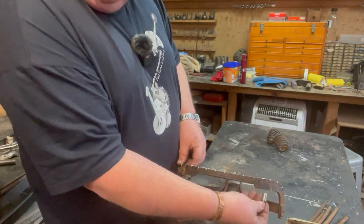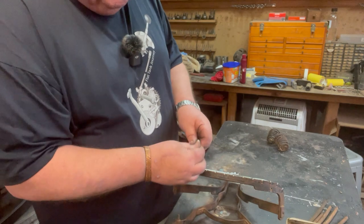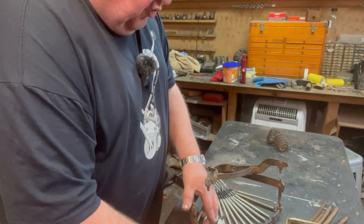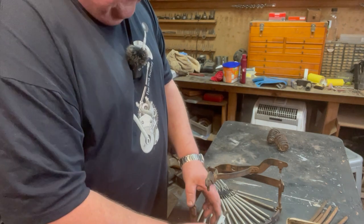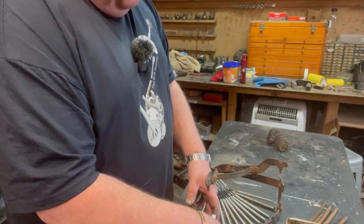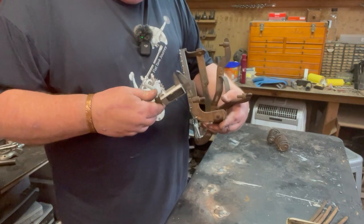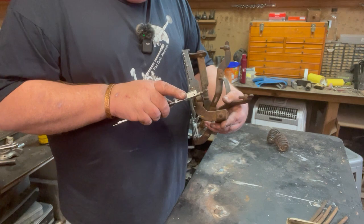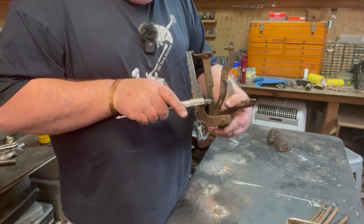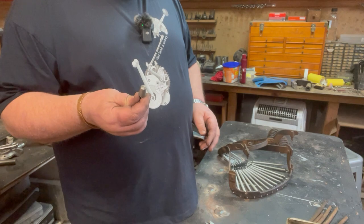Now they look a little more similar. I think I have the taper slightly wrong but it's going to get painted and the seat cover goes over the top, so overall I think it'll be okay. I'm going to measure this and work out what size slot to cut — it's about a quarter of an inch, maybe 3/16ths. The slot looks like it's about 14 or 15 millimeters deep. That piece was 19mm, so with about 4mm remaining I'm going to guess it's about 15mm deep.